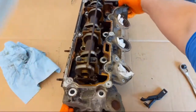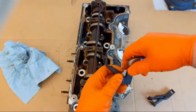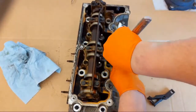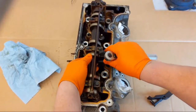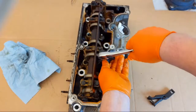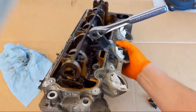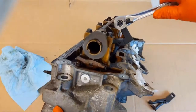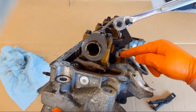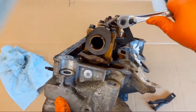Let me show you that quickly — this is really the way it counts. If I take this tool and set this up, there we go, that's basically how it goes. Now that's all set to press down and compress the spring. This is the one that works well: because of the position on that roll pin, the presser foot is located just inward from that aluminum part of the head, so when I press down it doesn't hit the aluminum.